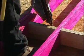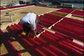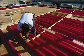Another application for southern pine in this project was the bracing that you see in between the studs. When we say bracing, we're talking about the smaller pieces of lumber in between the members. It offers lateral support between those lumber members, and it also offers additional fire protection.